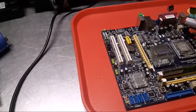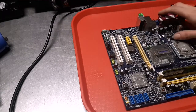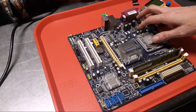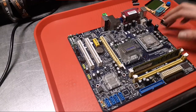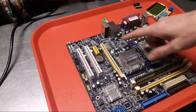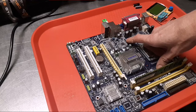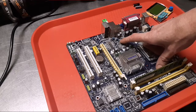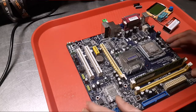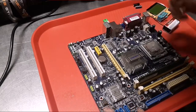So I got the caps out, like I was saying. I tested the other one, and it was around 1625. I think the other one was just over 16. So they're probably within range. I did check continuity in between those caps, and you guys, somebody out there probably knows. I guess it's normal that it dropped down to 15 to 17 because they're both doing it. And if it's not normal, then I have some other kind of problem.